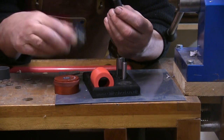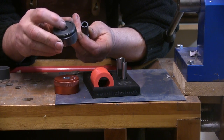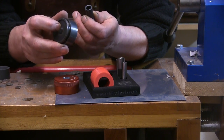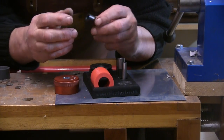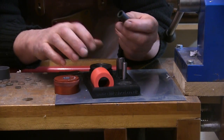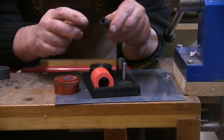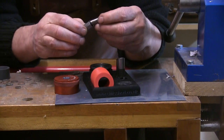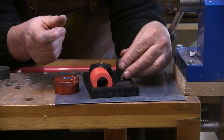The reason for that is the body — the top has got the 15mm bored out to 15mm, and then it's taken out from the back up to just short of the top, slightly bigger, so that the slug falls out. I didn't do that on the very original ones I ever made and you had to hammer the slugs out. But by tapering it slightly — just taking a little bit out from the bottom up to the top — when you've punched it the slug just falls out the bottom.